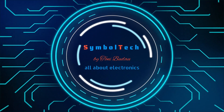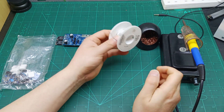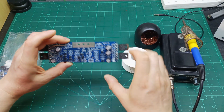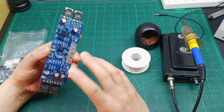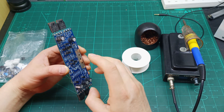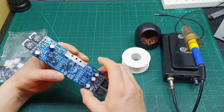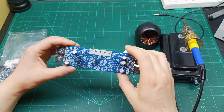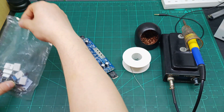We're going to build it, see how it performs, and see if it's a winner for this chassis. At my workbench I have everything ready — my soldering station, cleaning tip, and some soldering wire. I've already installed the transistors and capacitors on the board, matching the other channel to make sure the transistors have the same HFE value, accounting for tolerance between transistors.